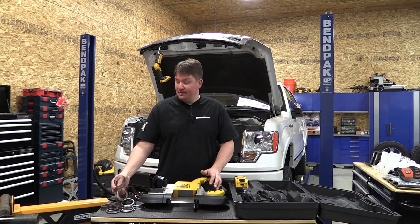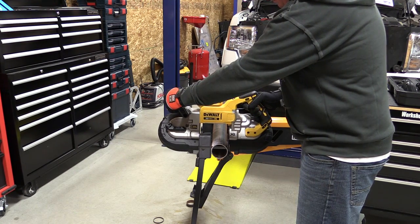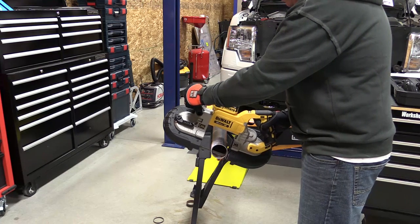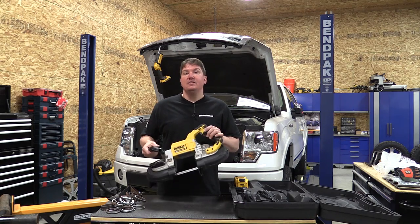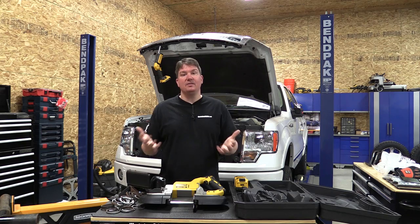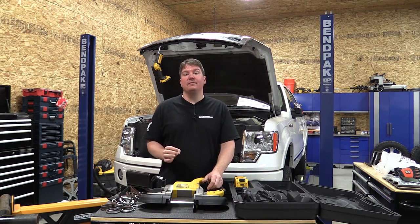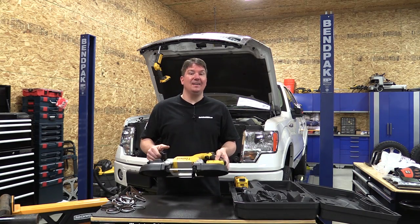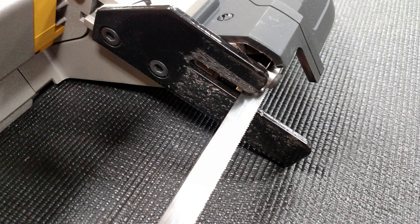Excellent run time overall. While you're watching the footage it probably looks like a small tube inside this big throat, but that's actually what I would use this for. These bandsaws are quite large, so for small projects or a lot of automotive work they're pretty big to fit in. There are more compact bandsaws that would work better for those situations, but for cutting something large this is excellent — I'd say anything two inches and above, this is where you should go.